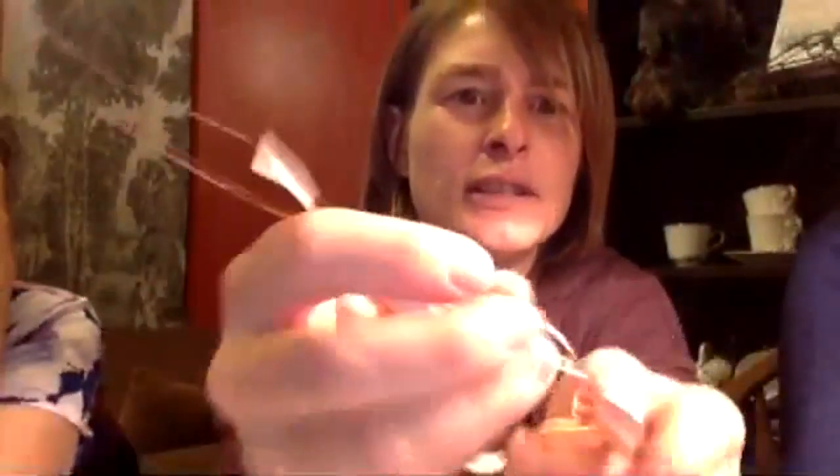It's amazing. So then on the spacing between the coils here, do we have the two that aren't together? You want these? No, the one that was straight. So we've been working with 18 gauge, and normally I've made 18 gauge coils much smaller, but we made them fatter this time. Is this a good distance? Can you see how they're laying? Okay, that looks like about 1 millimeter.